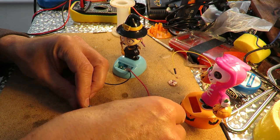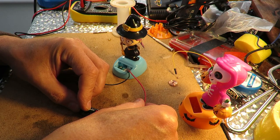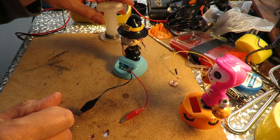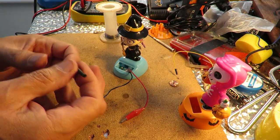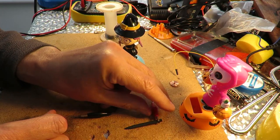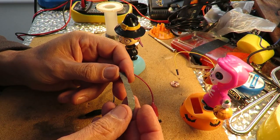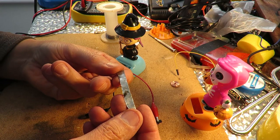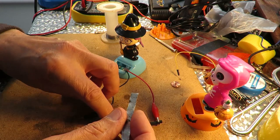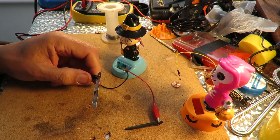If I just connect her up to a one-and-a-half volt battery she works absolutely fine. So if we can find the carbon or graphite — that one I think would be the positive — and then this bit of casing from the battery might be zinc, or certainly a zinc alloy of some sort. So we'll put that on the negative and then we need something with an electrolyte in it.